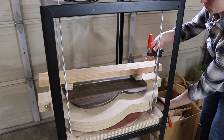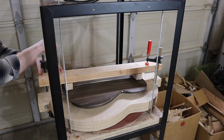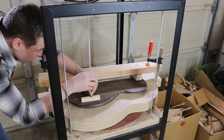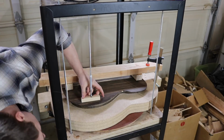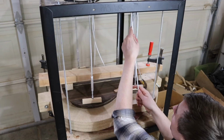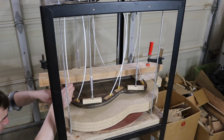Then I can put a bar clamp on each end to apply pressure. The other mechanism I came up with is just a threaded rod with a turnbuckle. I have 4 of these I can place on and cinch tight against the top of my go bar deck. Besides those, I'll just be filling in all the empty space with the flexible rods.